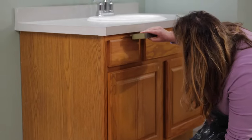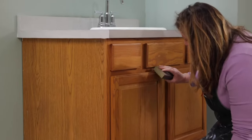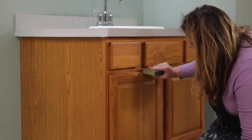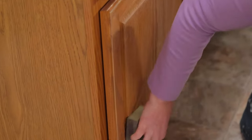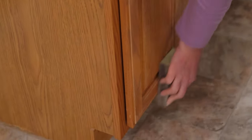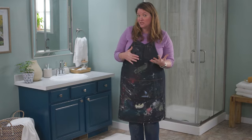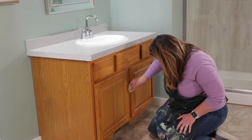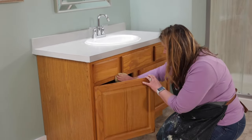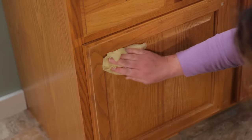Now it's time to do some sanding. We really need to rough up the surface so the paint can adhere better. If your bathroom vanity has a clear finish, use a 220 grit sanding sponge or a palm sander to remove that gloss. You really want to rough up the surface until it has a dull finish. I prefer a sanding block because it's easier to hold and gets into all the detail work on cabinets. Once the piece is sanded, clean up the dust and give the piece a wipe down using a tack cloth to pick up any of those remaining dust particles.